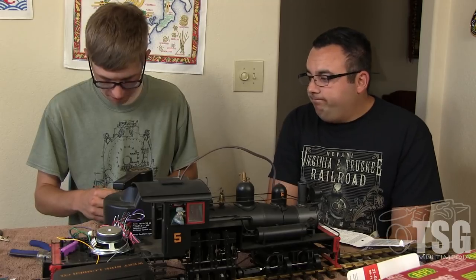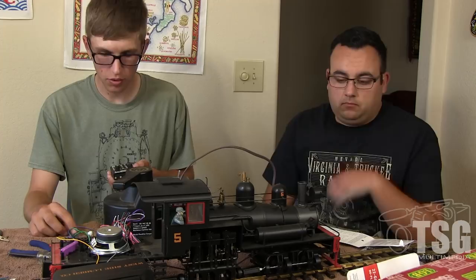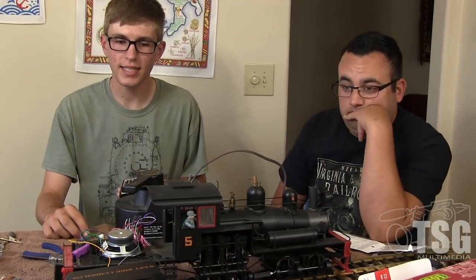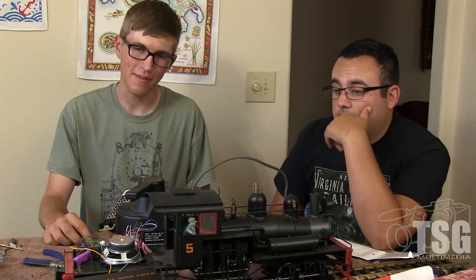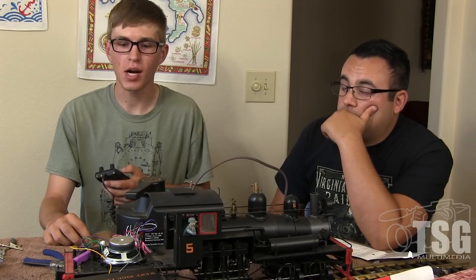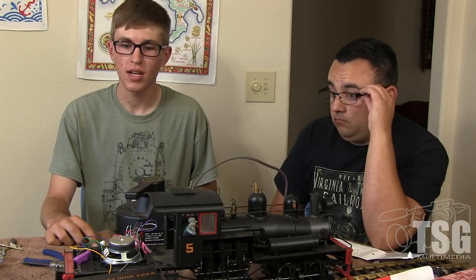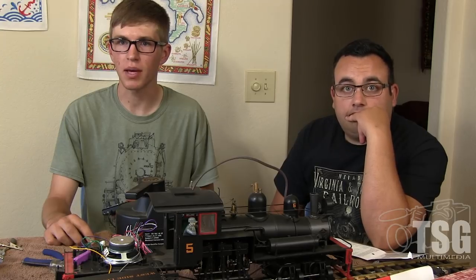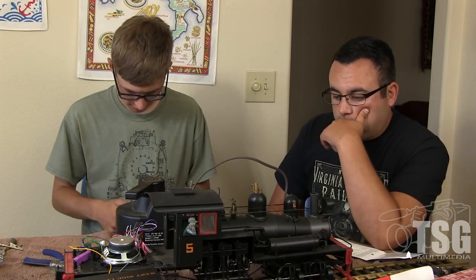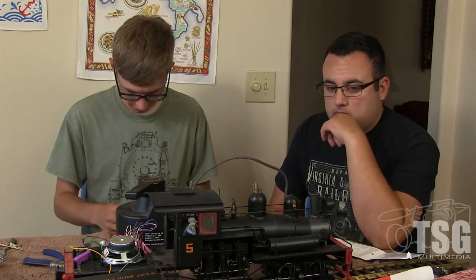So now, the other thing is that it turns out these older Digitrax throttles won't access index CVs, nor will they access 28 functions, apparently. So we cannot turn the firebox lights on, unfortunately, so we can't test that. But the headlight works, the backup light works, and we can program the sound, so it's a good start until we can get something where we can program it better. Right, and as long as you're not running it at night, people wouldn't probably see the flicker anyway, I think.